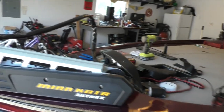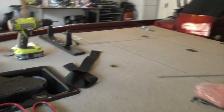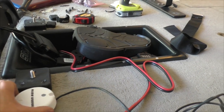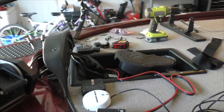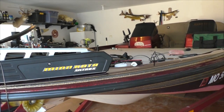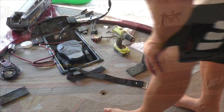It's the power cord and the transducer cord for your locator, and there's this little pigtail you have to buy separately — it's called a US2 adapter. That's only if you're going to be using the trolling motor transducer, which I am because I don't have down imaging up here — I just have CHIRP. Then you take your lead off the head of the motor and plug that in. Don't make the same mistake I did and leave the store without that little pigtail — it's called a US2 adapter for the transducer for your locator.